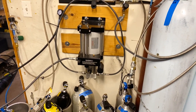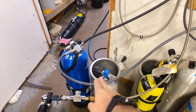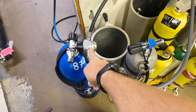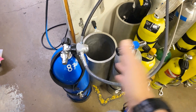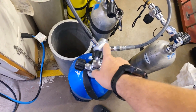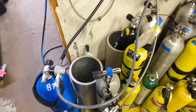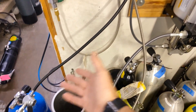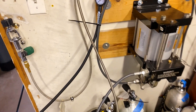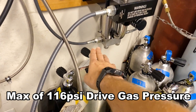This particular booster is the GB40. We have our drive gas being plumbed into the side here, and in this example I have it set up with our mobile setup, using a traditional regulator with the IP adjusted all the way down to 110 PSI. We've got an OPV on the side of it just in case the first stage were to fail — it'll bleed out the OPV rather than damage the booster or a hose, since we don't have a second stage on there. Then I've got a quick-disconnect hose up to an intermediate pressure gauge so I can see that we're not exceeding what the USUN boosters are permitted for.